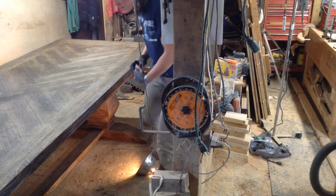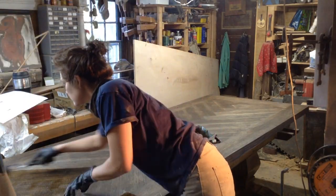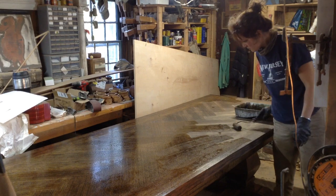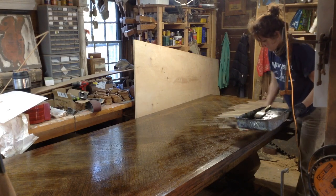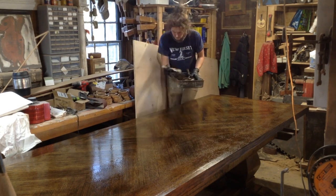I forgot I wanted to shim this up, so I'm adding some little painter's triangles on the bottom side so I could paint the bottom and the base as well as the top side all in one go. I'm going through and putting Waterlox on this. The customer wanted a semi-gloss finish, which for Waterlox is nice because I could just use the original finish — this already has three coats on it. I'm using the roller but then I'll go back through with a brush. So far it was looking pretty good.